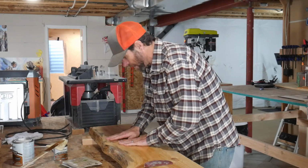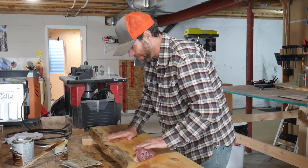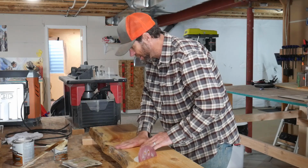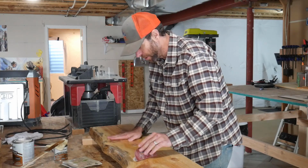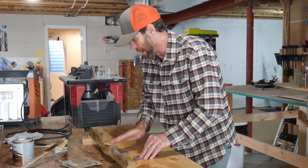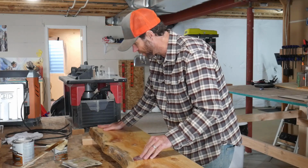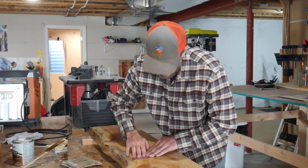Okay, as you see, as I'm going along, I'm running my hand behind the sanding that I'm doing. I want to feel, one, that we're getting back to a smooth surface, and we're calming down that grain again. And two, I'm wiping away the residual polyurethane as it comes up. That helps before I get the mineral spirits and clean it up, but I want to make sure I'm smooth again. I want to make sure I'm getting some of that dust up as we go.